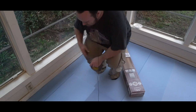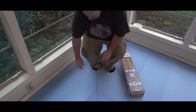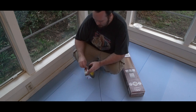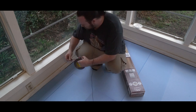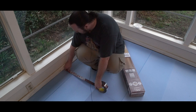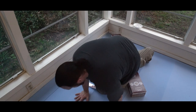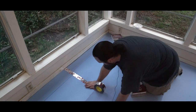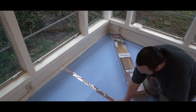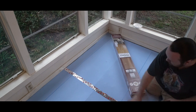I've got about a two-inch overlay on my underlayment, and basically right here there's about a two-inch area. I'm going to tape that off to help with waterproofing a little bit. This tape is basically duct tape, but not exactly — this is the stuff they actually use on air conditioning ducts because they don't actually use duct tape on ducts, which is weird. Anyway, this is just going to help keep it waterproof. I'll run probably two layers down here.